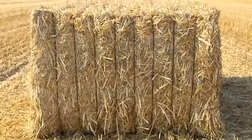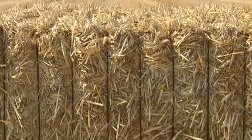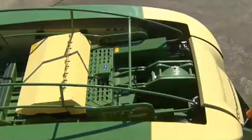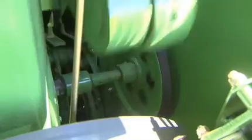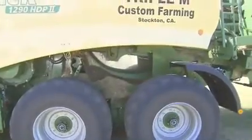Each HDP2 bale is tied by 8 threads, the clearly visible trademark of Krone HDP2 high-density technology. The pneumatic cleaning system keeps the knotters clean and ensures all 8 knotters work dependably. A mechanical knotter fan is also available as an option for machines that operate in extremely dusty conditions. This fan establishes a permanent airflow and keeps the knotter department clean and free of debris.